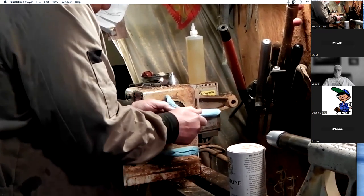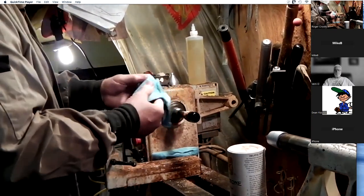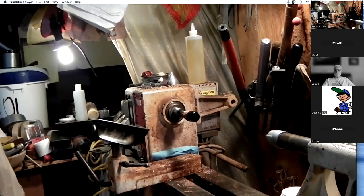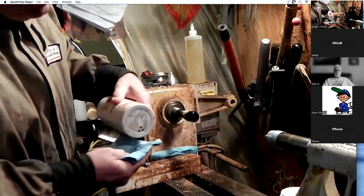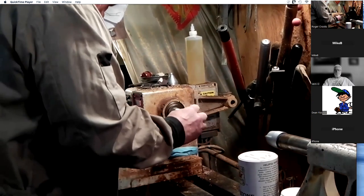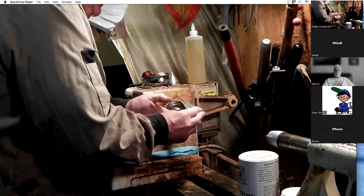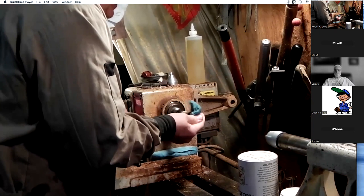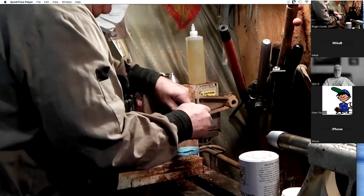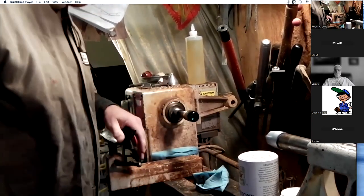I now carry around a salt shaker with diatomaceous earth instead of pumice and rotten stone — it will do the same thing better. Just a little diatomaceous earth in your pad of paste wax will polish whatever you want to a very nice shine. I did this at the last wood show out at the expo center — craft supplies was right next to the Northwest Wood Turners booth, and they had us helping people turn pens. So I took my wax down there and we were using that to finish the pens. Kirk DeHeer was there, and six weeks later, there was 'Dr. Kirk's Miracle Polishes.' There are no new ideas — someone else I got it from, he can have it from mine. I don't mind him pirating the idea; I do mind him pirating the degree. So, not a doctor.